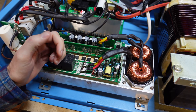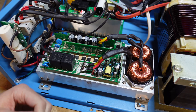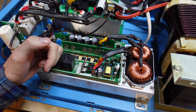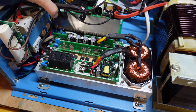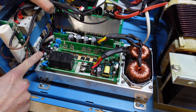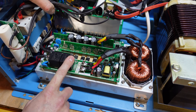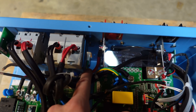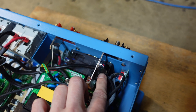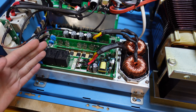It wasn't until recently that I thought about this a little more. This inverter supports multiple types of batteries — various forms of lead acid, lithium iron phosphate, and so forth — and you can select that with a small dial on the front of the inverter. However, I noted that on the wiring of this charge controller, we have two conductors for the PV input and two conductors for the DC output, and there are no communications cables coming from the control board of this inverter down to this charge controller. The positive from the charge controller comes up to the positive bus bar and the negative cable comes up to the negative bus bar. So it doesn't appear that there is any way for this inverter to control the charge voltage or even control this charger at all.